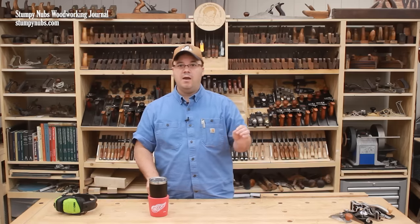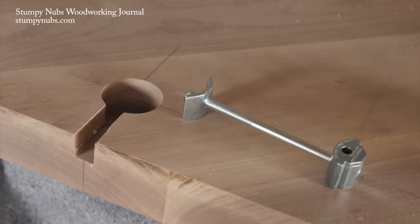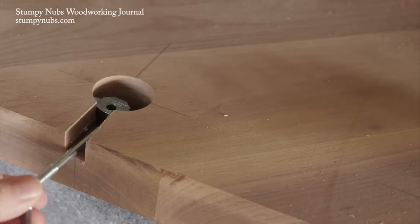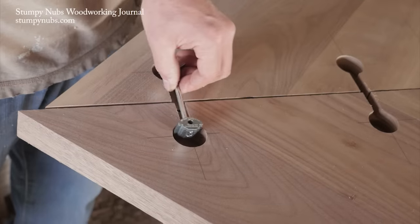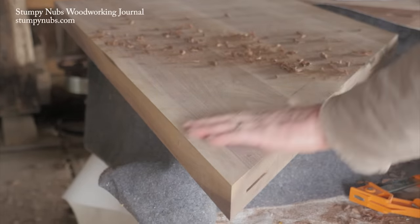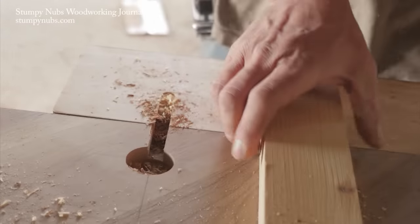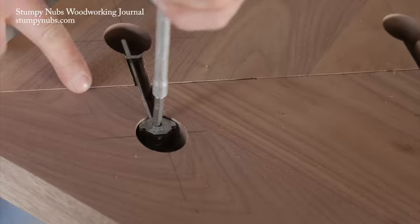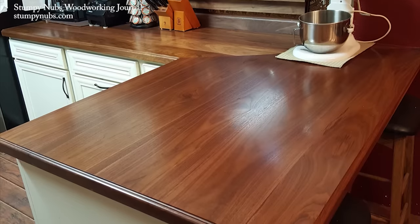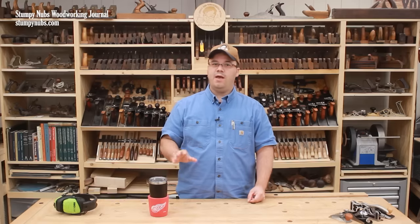A large miter joint like this is unique in that it will try to open as the wood moves. So in this case we used what are called draw bolt joint connectors, sometimes also called dog bone connectors. They require a special slot that is easily created with a Forstner bit and a simple router jig — I'll link below to both the bolts themselves and to another video showing the installation process in more detail. I like these connectors because they are very, very strong — this thick slab countertop will never come apart. Both joints in fact are very strong because we took the time to understand the unique nature of each type of joint, and now that you have that understanding too, you can be confident when you have a large corner to connect.